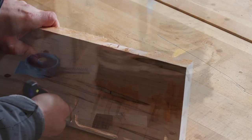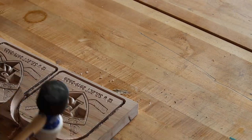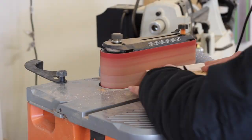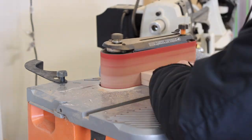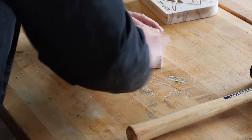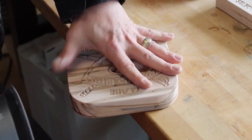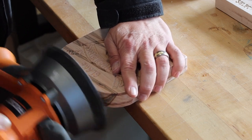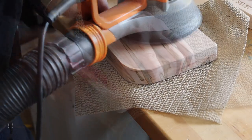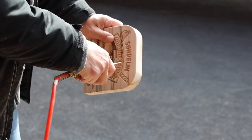While those two were being milled I got to work on the first set. On the first piece of stock my depth in the profile pass was not quite deep enough, but nothing that a little gentle persuasion with a chisel and mallet couldn't fix. Off to the belt sander to clean up those tabs, do a first pass at those sides and relieve some of those sharp edges. A little bit of hand sanding quickly cleans up any burrs left by the v-bit. I use my palm sander with a fairly high grit to clean up those sides, then use the air compressor to get rid of any dust as well as a tack cloth.